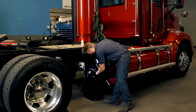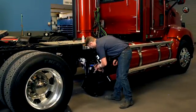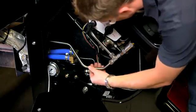Examine for frost or ice around tubing or connectors — frost is an indication of a loose fitting. And finally, check for signs of damage to tubing.